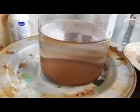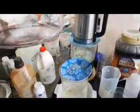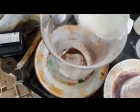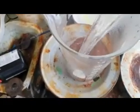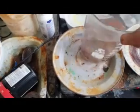I don't need to do a big wash, because it's already been through the hydrochloric acid and everything. All I'm doing now is rinsing off all the hydrochloric acid. I'll give that a few minutes and I'll put the third wash in. Well, that's been less than 5 minutes. Probably 2 or 3 minutes, and it's already settled. So I'll pour that off now, and then I'll do the third one. So if you look at it now, you can see that it's all granulated, which is good. So I'll put the third and final water wash in. And I give it a good swirl around, make sure it's really getting rinsed off. And let that settle, and then it's time to dry it and see what we've got.